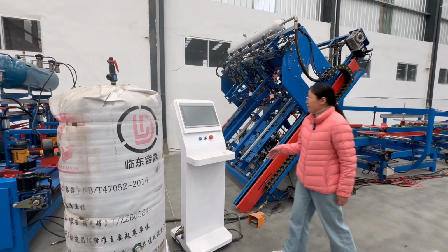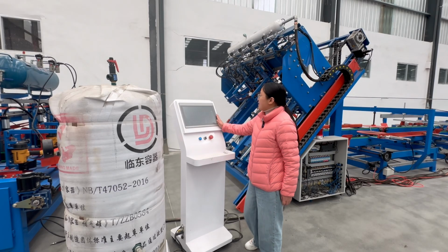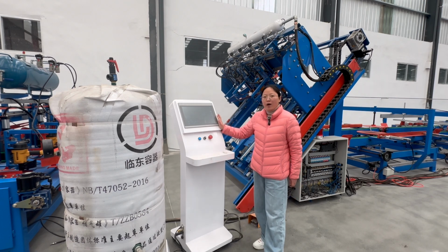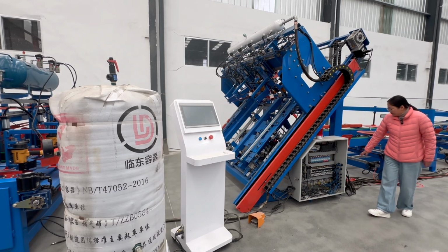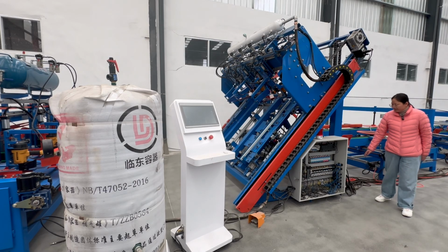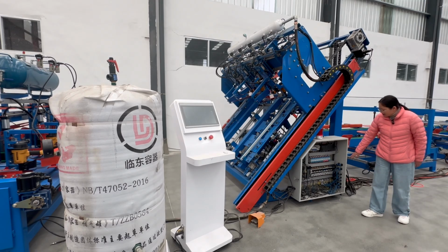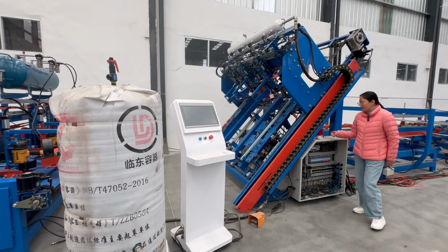And here we first introduce our electric cabinet. It has a 15-inch touchscreen. Here we can set the position, the number of the nails, and adjust the nail speed is also okay. It can also remotely monitor and troubleshoot, and it can also remotely upgrade the program for life. For our machine, it also uses the aviation plug for easy link and wiring. The PLC we use is Siemens, and the electric component is Chint. It has the alarm, which timely reminds us if the machine has any problem.